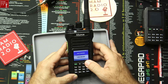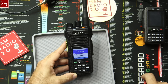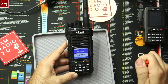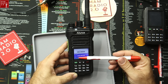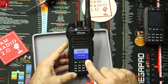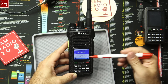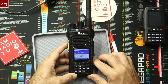To switch modes, hold down this button. Now it's in channel mode right there — you can see channel mode, channel two. Hold down the exit button and it switches back to VFO. You'll notice the sub band is still in channel one. So you can be in channel mode on one band and VFO mode on the other, and switch them independently. Now VFO mode for both bands, back to channel mode for one band, back to VFO for the other — you can switch them back and forth however you want.